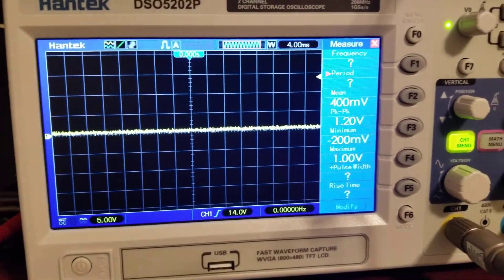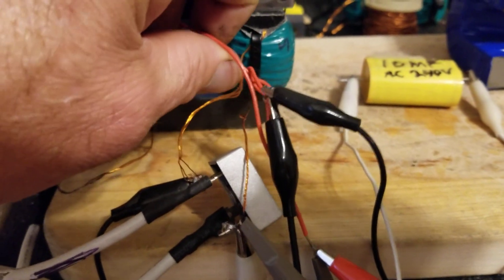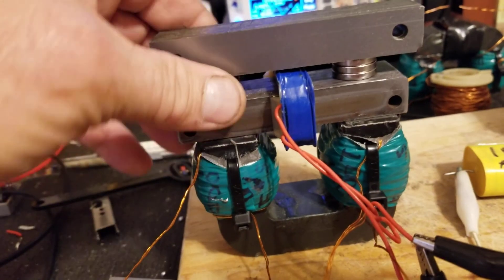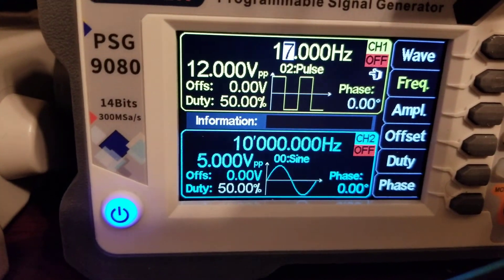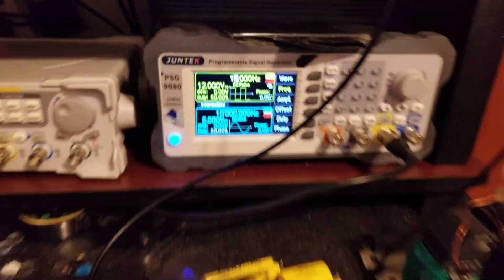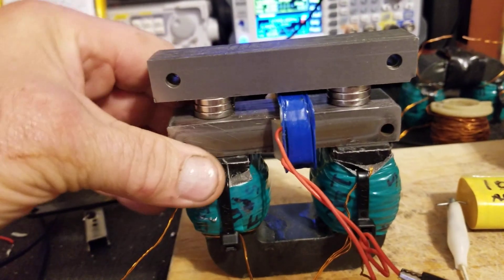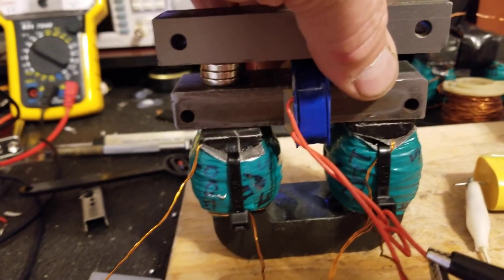This scope here is sampling the tickle coil — the drive coil. I like to call it the tickle coil because we're just tickling this flux back and forth, so everything's confined in here now. I've played around with different duty cycles and 50% seems to be the magic spot. I've tried a lot less, all the way down to one, and it doesn't seem to do much, but right around 50%. I've messed around with 48 — sometimes depending on what I have for a load it seems a little better, but for now I'm just going to run it at 50.